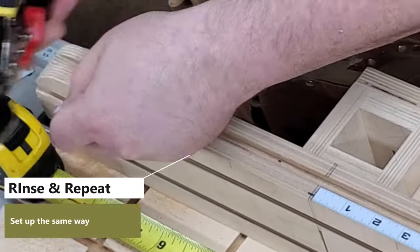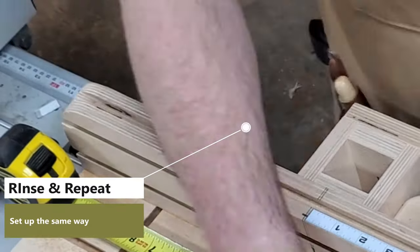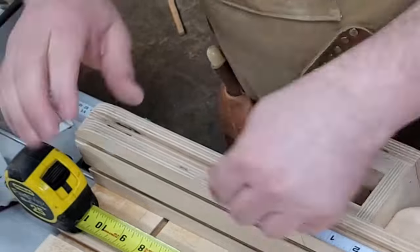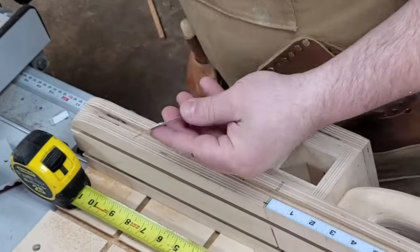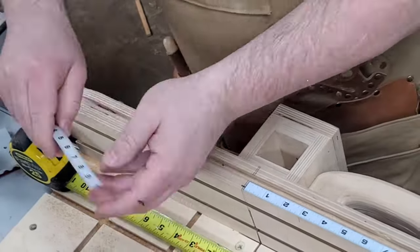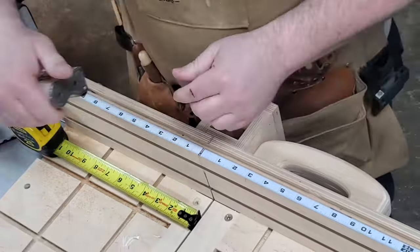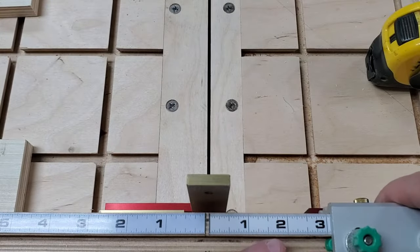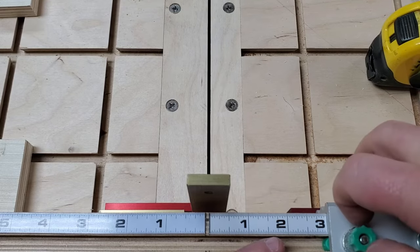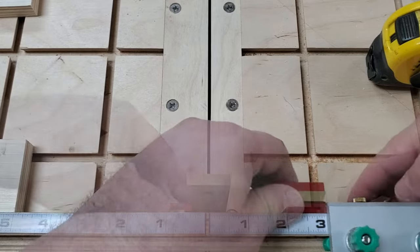And this is the peel and stick left and right tape measure from Kreg. And it's a lot longer than I needed, but I do have a plan. I'm going to use these on my miter station, which I won't need those tight tolerances there. So having that extra going off to the right, I'll have plenty of use for that. And I'm using a Sable hand roller to roll that in just to make sure everything's nice and snug. I don't want any air pockets. I don't want that thing to come up when I'm in the middle of use.